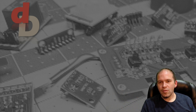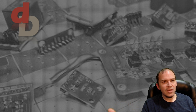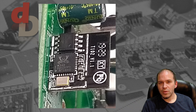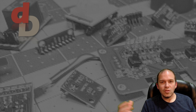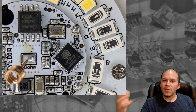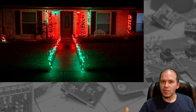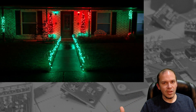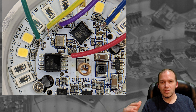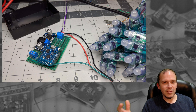That's a quick comparison of the new and old Lohas bulbs. We knew something would change right after we posted the comparison video. The Inshine bulbs that did so well also changed — they moved to RTL chipsets, so you can no longer flash them with open-source firmware. Shame on them. Lohas, if you're watching: stick with the ESP8266, or move up to the ESP32. You'll sell to both the regular app market and DIY tinkerers like us. It's a win-win. And we'd love it if you could keep the RX/TX pads, as well as the 3.3V, GPIO0, and ground pads — please keep those available.